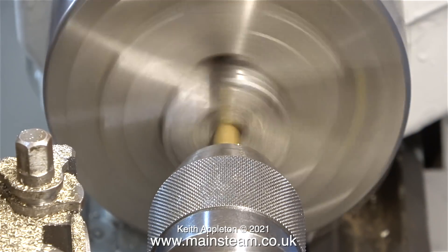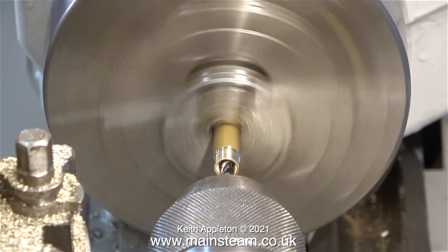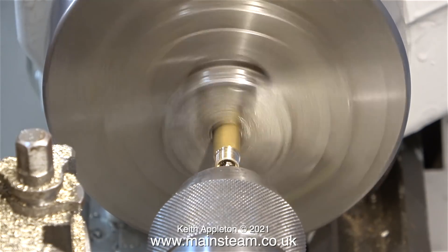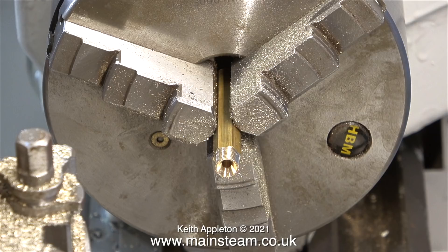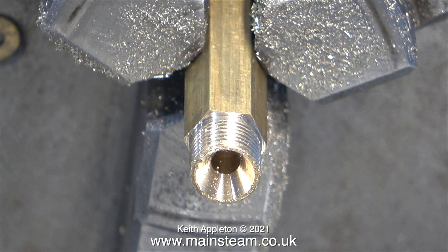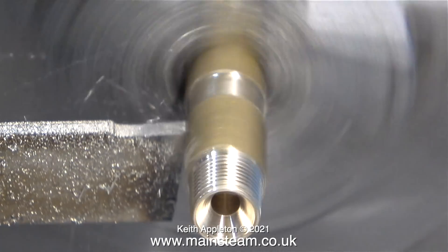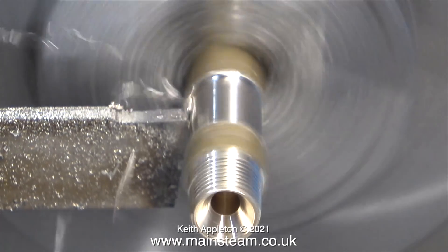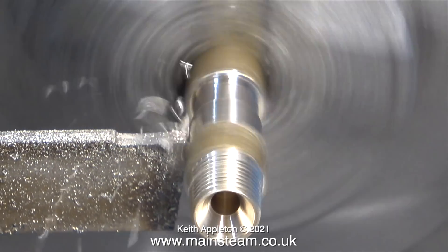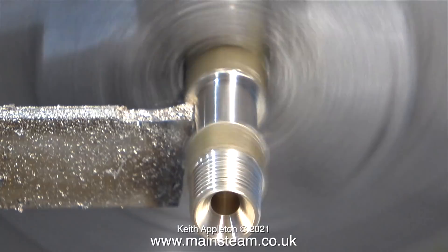A thread adapter is not going to be much good without a hole through the middle. Here I'm initially drilling the hole using a centre drill because I also need the cone part of it, then I complete the drilling using a one-eighth of an inch diameter twist drill. I'm drilling further through the piece of brass than I need to, so when I part it off I can be sure that the parting tool will break through to the hole. I then checked that a union nut with a coned union fit the part, and as you can clearly see it looks okay — the die has even bevelled the edge of the hexagon, which is good. I'd also like to show an operation that you shouldn't really do but I do frequently: using a parting tool as a standard cutting tool. You can only take very slight cuts and this doesn't work with removable-tip parting tools — the tip will just fall out — but it's okay for reducing diameters when you just need a diameter to be soldered into something.